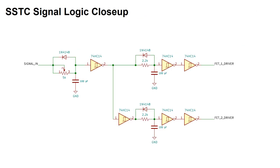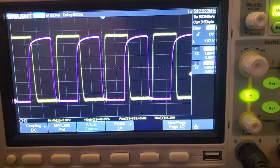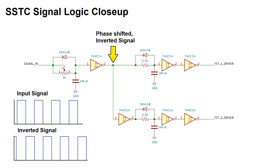It's kind of hard to tell what's going on from the schematic, so let's zoom in for a closer look at the signal logic. The 555 timer signal comes in and has its phase shifted by an adjustable RC delay circuit. The phase shift part isn't really important for this video, but I will cover it in the next video. The signal on the output of the first Schmitt trigger looks pretty much the same aside from some phase shift, and it then gets split off into two branches.